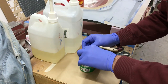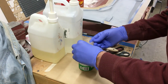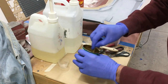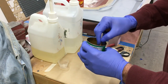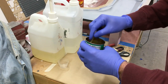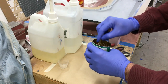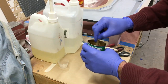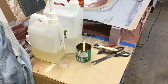I'll add the hardener now. What I'm going to do is mix the whole batch up, but when I add microspheres and fillers to create the splooge I won't use it all — I'll leave some resin in the container so that if I need a little bit more resin later I can add it, or I'll have some ready to begin the layup.